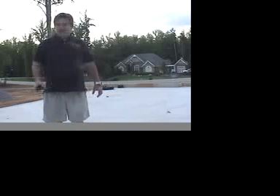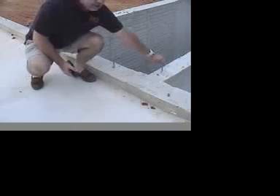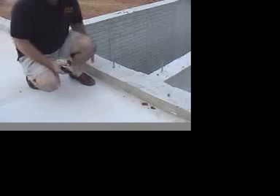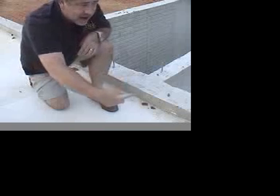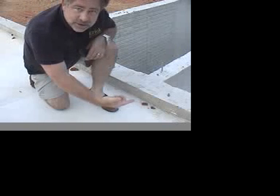I'm standing on what is the slab for the garage. It's a two-car garage, so it measures about 20 by 20 feet. And over to one side here there's a little niche where you can have a workbench area. Let's take a look down here — you notice these little pegs. When the first layer of wood goes down on the house there's going to be what's called a band board, and these are the points where there will be straps that tie the house to the foundation. So the house doesn't just sit there — it's actually wrapped around some steel pieces that tie it to the foundation.